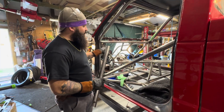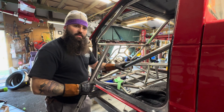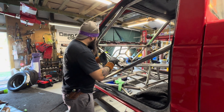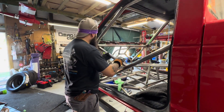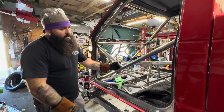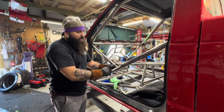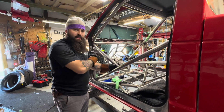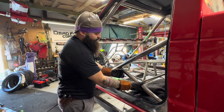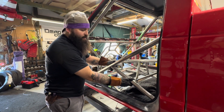So this pipe is for the other side of the X-brace. This does not have to be the same size — this bar has to be inch and five-eighths, but this one can be inch and a half, depending on what material and thickness you're using. We cut this bar, measured it, it fits great. Since this is the last cut and I started with this one, then did the intersect point, if you flip it and reverse it, you'll get exactly the correct angle you need for the other side if you do your math right.